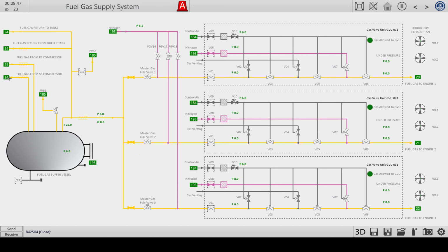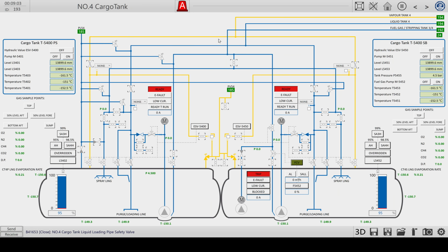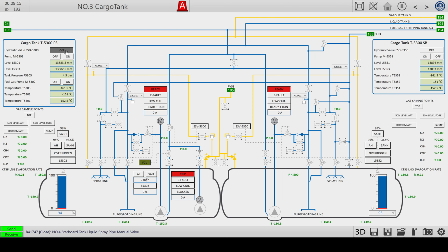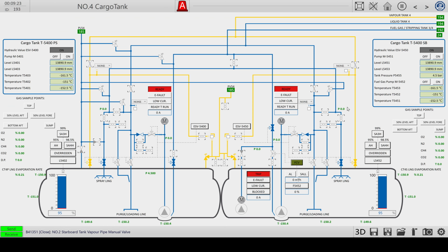Gas supply, as we said. We're going to provide this vaporizer with liquid LNG via this blue line that goes to tank 3 or 4. I'm now on cargo tank 4. We're going to pump it out of the cargo tank with this gas fuel pump. Let's first turn on the hydraulic controllers from all tanks. We're only going to need tank 4. So we're going to pump it out via this valve. You see this control valve is automatically turned on, up here and this bottom line, the fuel gas line. So I'm going to turn the gas pump on now. You see that's running, that's providing pressure.